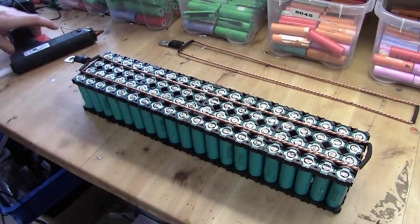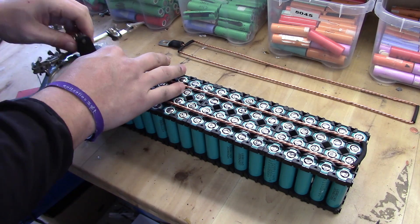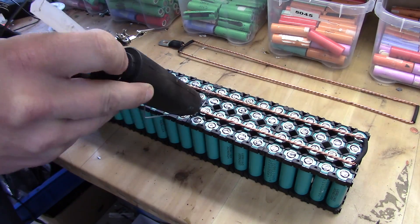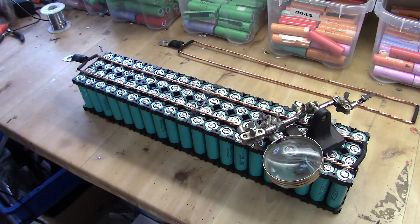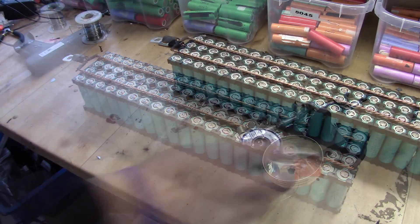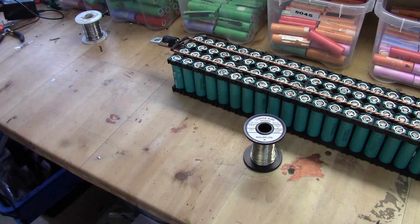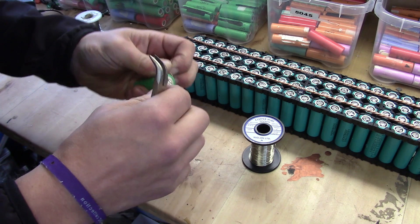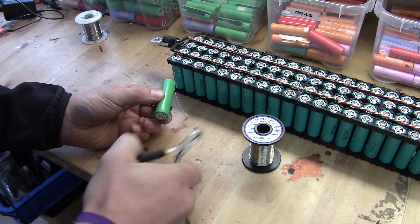When both are done it's time to attach them to the battery pack. You need to make sure they are somewhat aligned, and in my case I'm using hot glue only because it's simple and it works pretty well. I also add some hot glue inside here to join that together a little bit. I am fusing every cell to the bus bar and I'm using this type of fuse wire — it's rated roughly 5 amps, which should be more than enough. For the other side I'm using a little bit thicker wire which is not acting as a fuse, but before doing this you need to make sure that the fuse wire meets your demands.